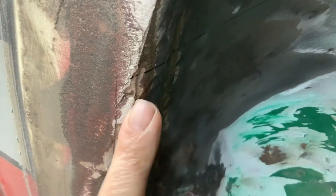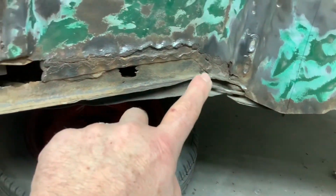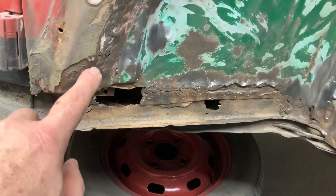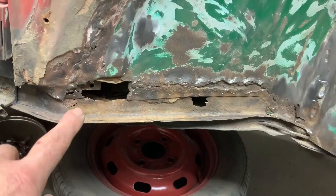There's the line that needs to follow, and I took a bearing off here because this is the one that got welded in. I'm going to try to follow this weld all the way down and bring my piece up to there, weld it across there and down along that edge. I'm going to cut this out, clean all that rust up, and put some anti-rust in behind there just to protect it so that will stop any additional rusting from happening.